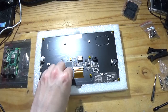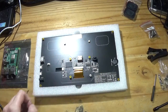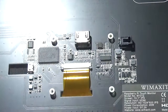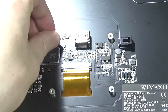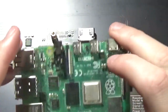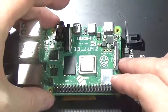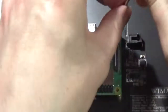The best thing to do is remove all of the little film pieces that are on top of the screw holes. I can clearly see where a Raspberry Pi would go but it won't go straight on from memory — it needs some risers, which are in here. So they're on like so. We can now place the Raspberry Pi with the HDMI ports facing upwards, in the same orientation. You don't want to put it the other way around — it goes this way. Then you're provided with these little screws and a screwdriver so we can fix the Pi board on.